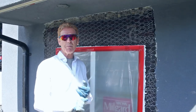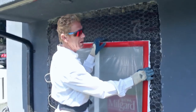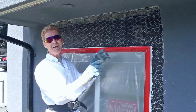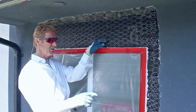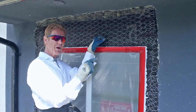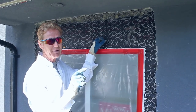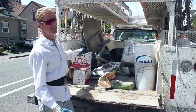If you're doing acrylic, apply the primer that comes with it. We're not going to get into which specific acrylic we're applying right now because they're all real similar. What I'm going to show you is the method — doing the scratch coat, brown coat, and the acrylic all the same day. That takes a bit of practice, but I'll show you anyhow.